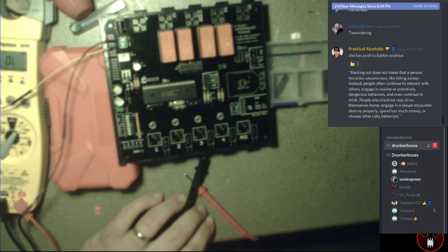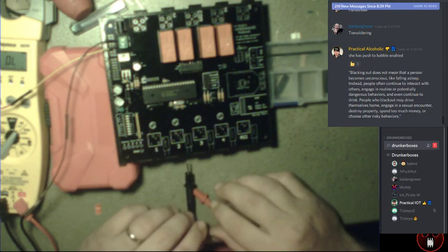So from a practical perspective, and I'm not being snarky, I'm actually curious, why would you want this? For remote antenna switching. It's intended to be put up on the side of an antenna tower, and to give you the ability to switch which antenna you're using from inside the house, without running individual runs of expensive, highly lossy coaxial cable into the house. So you just run the most expensive one? Exactly. You run one really, really high quality run, and then you switch it remotely.